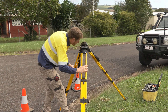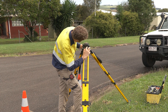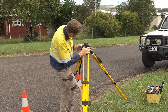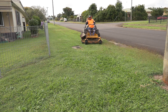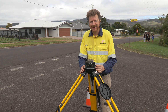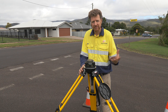We're off by about 10 millimetres, so we'll adjust our levels. The trick when leveling is to start with your leveling screws in approximately the center — many tribracs contain a little groove in the center that shows when you've got them roughly in the middle, giving you play in both directions. We're in the middle of leveling the tribrac and the local contractor has rocked up to cut the grass on the nature strip — a great example of how things can go a little bit south when setting up a base station, and how your base station can be disturbed during a survey session.